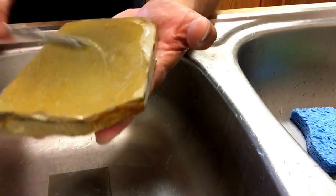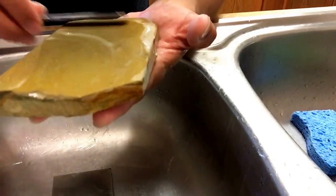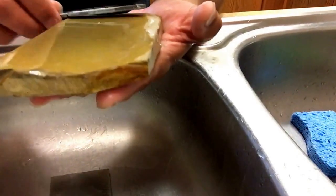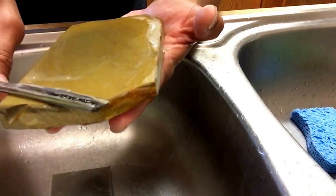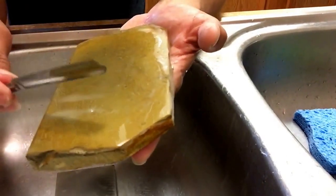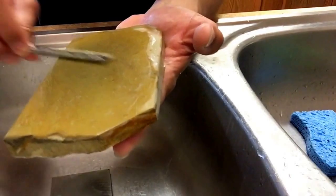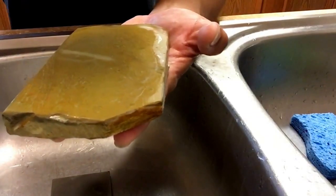You always want to keep looking at your slurry, making sure that it's undercutting from every aspect of your edge, right? If you're gonna do this, do it on a razor where you set the bevel and it is wide. This is a very small razor, so the bevel is hard to see in one of those 40X's. A microscope, it will be fine, but add some water.